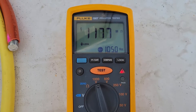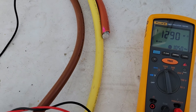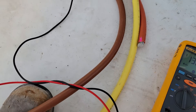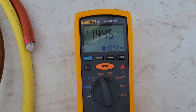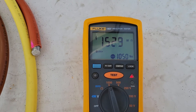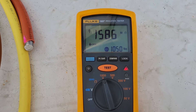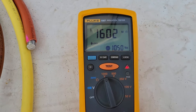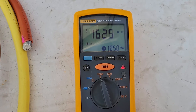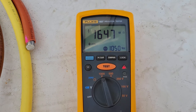While we're doing this test, the other end of these cables has been cut, wrapped with tape, and there's somebody guarding the location where these cables are. Because if you get to where you can touch the conductor on these cables, it will shock you. Make sure you've got somebody guarding the other end and you've got them wrapped up good with tape so nobody can get shocked. It won't kill you, but it will hurt — similar to an electric fence.